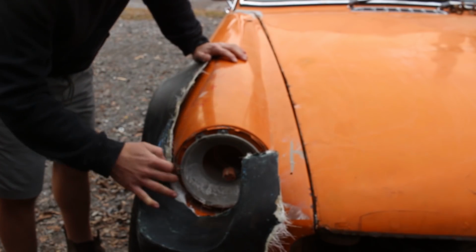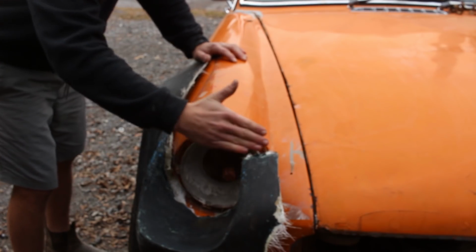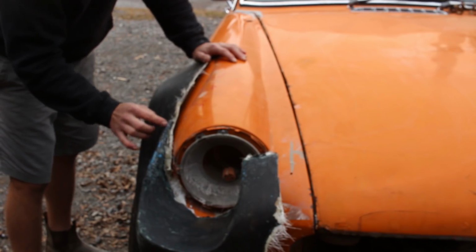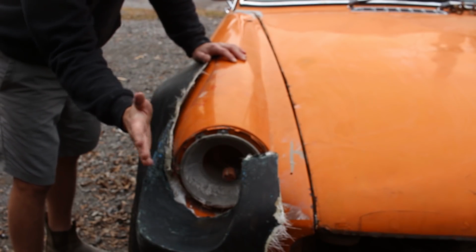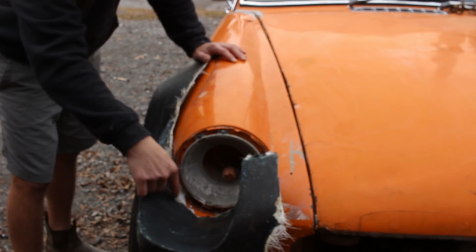When you get to the headlight, we've got some issues here that need to be trimmed out, but the headlight bucket actually goes out this way instead of wrapping around and tying in down there. Now there's a few issues that caused that. I think the main one was that when I bolted this together and flipped it up on its face, the headlight bucket, the weight just kind of pulled this way, so it led to a headlight bucket that goes outwards instead of wrapping around the headlight. And then there's some stuff in the way.